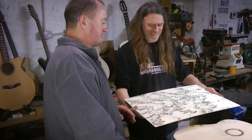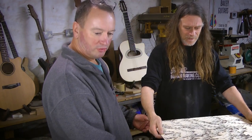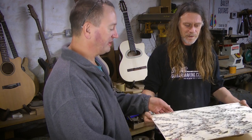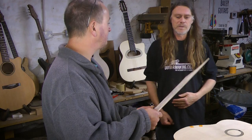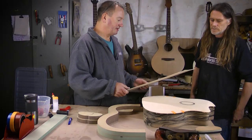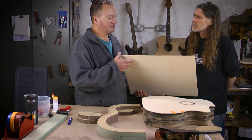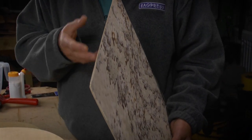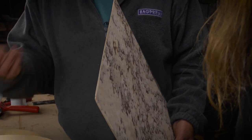Let's talk about veneers. Would you call them veneers or laminations? The individual layer of wood is called a veneer. Once it's bonded together, I'll refer to that as a lamination. A laminate is a different term — that's more often applied to a product like Formica, which is a high-pressure laminate. But this is a lamination: layers of material bonded together.